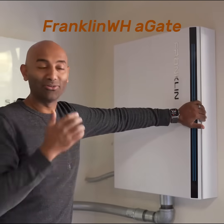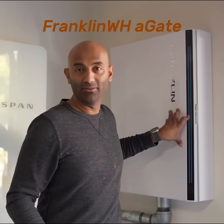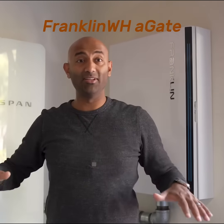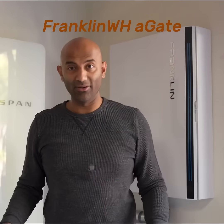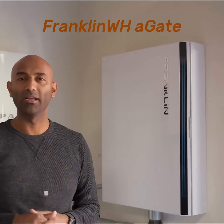There's one more feature I hadn't even considered. What happens when the grid goes down if you don't have batteries — normally with a solar system, the system says there's no grid and shuts down into standby mode. But because I have batteries, that never happens. The batteries kick in and the solar keeps working.